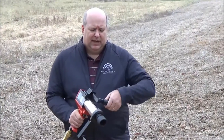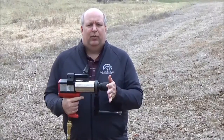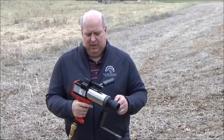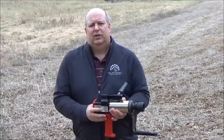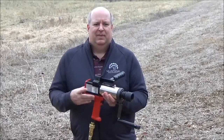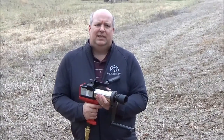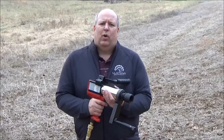The base unit comes with a secondary stabilization handle, custom-made reaction arm, and three tips that suit the most common trap manufacturers. We include 20 feet of hose and all the fittings you need. We include a filter regulator and lubricator so you have everything you need right out of the box. The unit is lightweight and easy to handle, and it's non-impacting so it's going to be very gentle on your operators and very quiet.